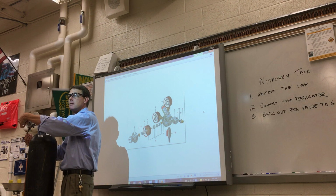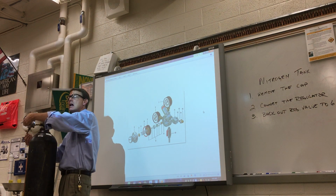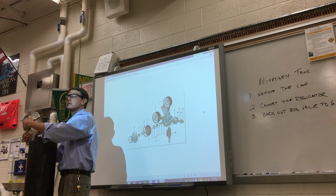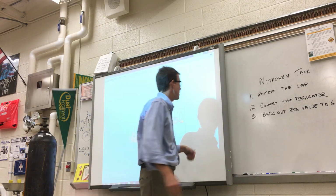Till eventually nothing. All right, so we can adjust it, but if you're adjusting it down, you have to have the Schrader valve depressed. Okay? So we're going to increase the pressure. You're going to turn the regulating valve clockwise.